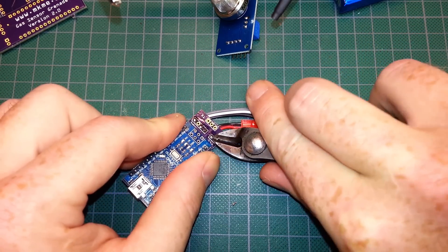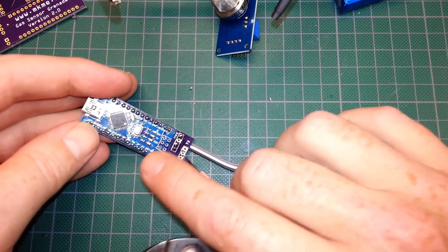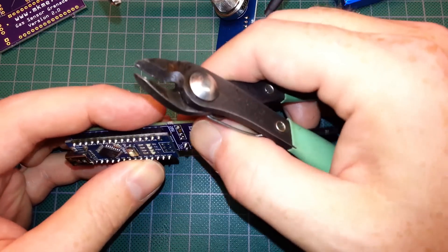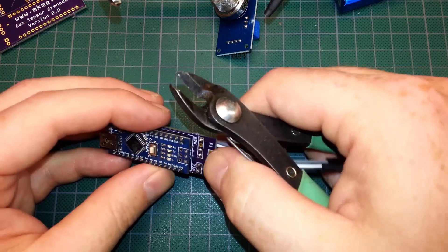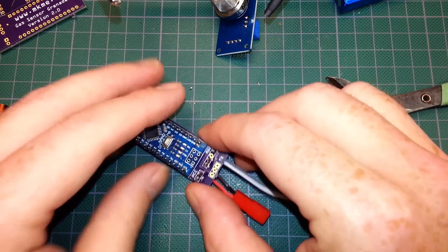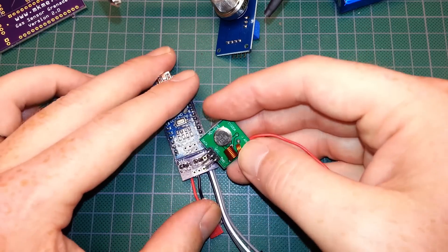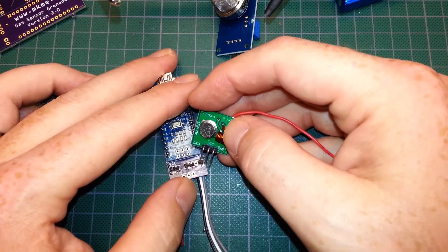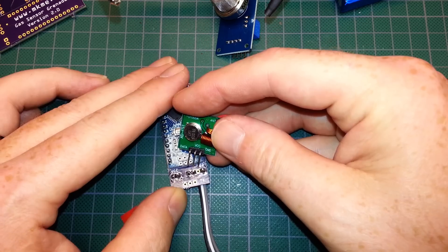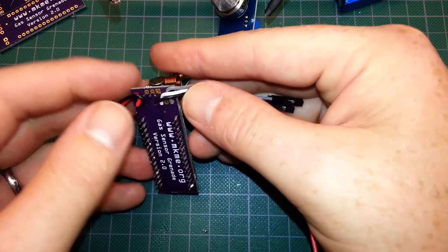What I'm going to change right now: we're feeding the MQ2 from the five volt on the Arduino, which is pushing it pretty hard. We'll change it to give it its own regulator, move things back a bit, and make it a better form factor — maybe double some things up. This is the first revision of these boards so I'm learning as I go, and it works pretty good so far.